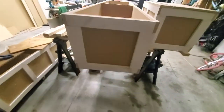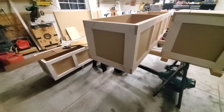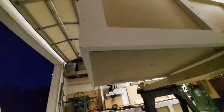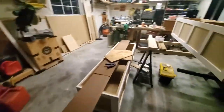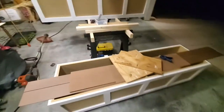I do plan on painting them outside and inside, so they'll hold up to a lot of abuse and be easy to wipe down and clean. They're going to get adjustable leveling legs on the bottom. If you go under here, the bottom has cleats — the long ones have one on each end and one in the middle, the short ones just have them on the ends — giving me an inch and a half of material to drill the threaded insert into for the leveling legs. I'll show that in a later step.